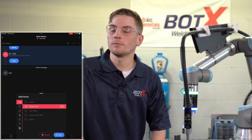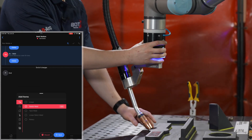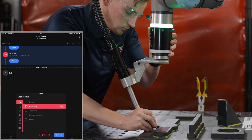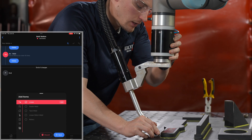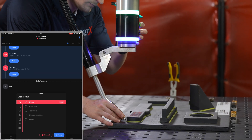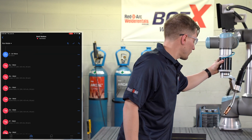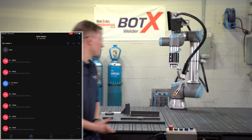On this part we have a radial blend, so we're going to select a radius weld in our app. Here's the first point of this radius, and here's the second point. From this point over it'll be a straight line so I'm going back into a linear weld. Then we select back into a radius weld because at the peak of this point it's arched as well. Once I'm satisfied with the locations taught, I gently move the robot back up into the air. We save this program again and now we have additional steps added into that original program.